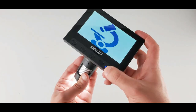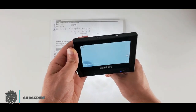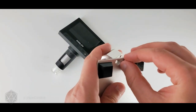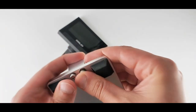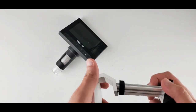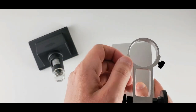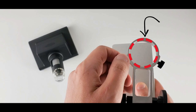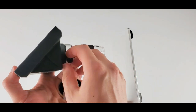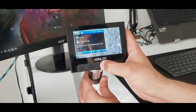First I will show you how the microscope looks — this is the screen you will see when you turn it on, and it is wireless, it just works like that. Let's set it up now. Take the base, place the screws like that, put the connector on the other end, and use a screwdriver to tighten. Then take the stand, place it here and rotate. Finally, unscrew the little black things, place the white plastic piece here — I forgot to do that — and place the microscope just like that. Tighten those black things again and the microscope is ready.